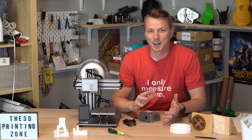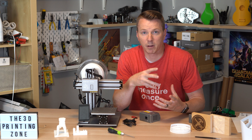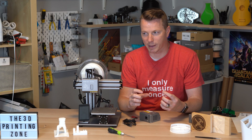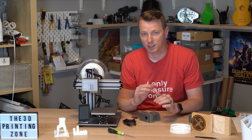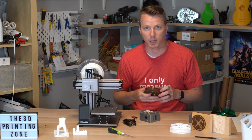Wood is fun, but I wanted to experiment more. I tried laser engraving the back of my phone case — I mocked up in Photoshop a little picture of myself along with my name and did a gradient on my name to see how it could handle that. In Snapmaker JS you've got multiple options for how it renders the laser engraving — dots, lines, and other options — plus different rasterization settings for how it handles the image. Then I took off my belt, which is leather, and tried the same picture with exactly the same settings. I just lined the belt up on the bed and let it go again, and that worked out really well too.